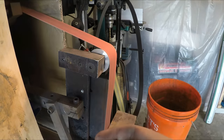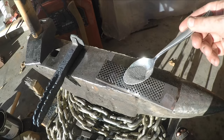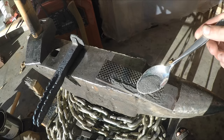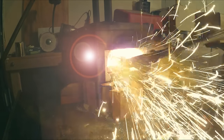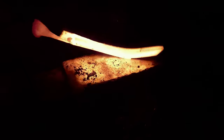I'm going to grind the area on the file where the forge welding will occur so I can maximize the surface area that comes in contact with the railroad spike. Then for the little divots left over, I have some 1084 powder steel that I'm going to put in there to fill in those gaps and help facilitate the forge weld. You can see to the left that I filed a wavy pattern in the railroad spike — that's purely decorative. I'm going to tack weld these two together so that when I'm heating them and taking the first few hammer blows, they stay oriented correctly. You can see all that 1084 blowing out of there with those sparks — that's the propane expanding rapidly as it's heated, blowing out the front and taking the 1084 with it. I'd like to think some of that was still left in the forge weld and that it helped, but I don't know.